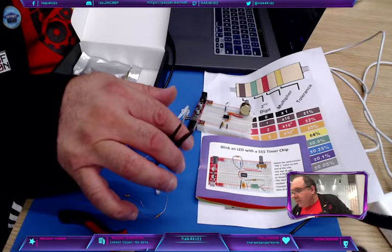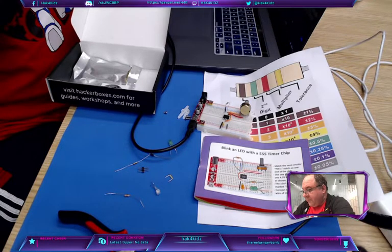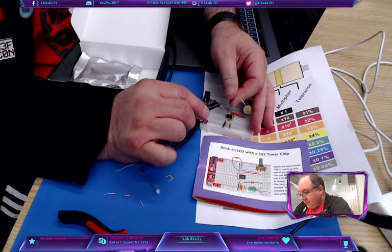There it is. Yes. So we take one end of it and put it at pin 3. 1, 2, 3. And then the other end doesn't really matter where it goes, because we're going to connect our green LED to the other end. One end goes into negative and one goes to positive. Short end is negative. Long end is positive. The positive is the other end of the resistor. The negative is on that blue minus sign rail. And I look like I am completely wired up.